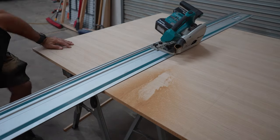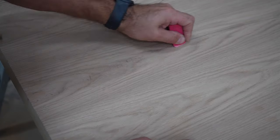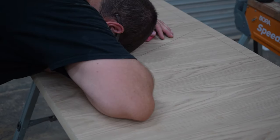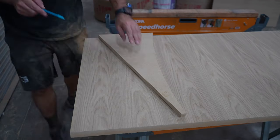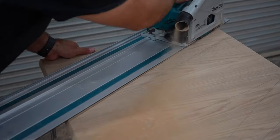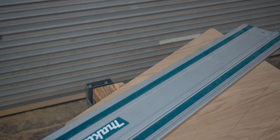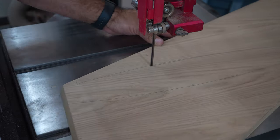The reason I have three saw horses is so the cut can be centered on the middle one so once it's cut all the way through, it doesn't fall. I got a little ahead of myself and traced the templates before I made the cuts, so I had to erase those before I could trace the new ones. It was at this point that I realized I didn't change the angle on the saw before I made the second cut. Once I cut the correct angle, I lined the template up with the short point of that cut, traced that one, then used the other template for the other side. Then I used the track saw to cut each of the pieces precisely on the straight line that will be the long point of the folded angle. Then I cut all the arches for each piece on the bandsaw.